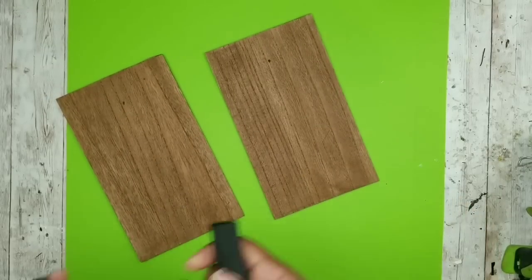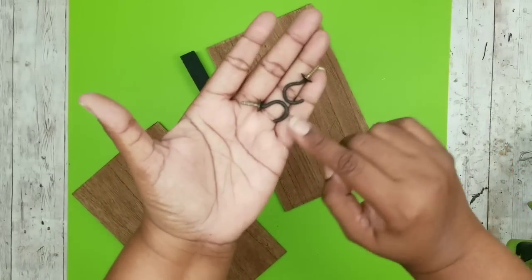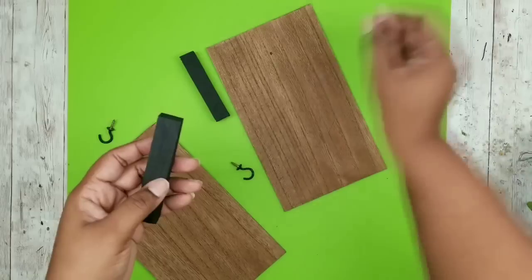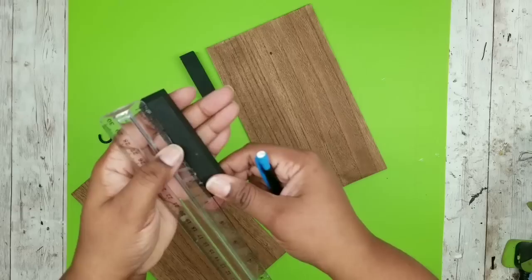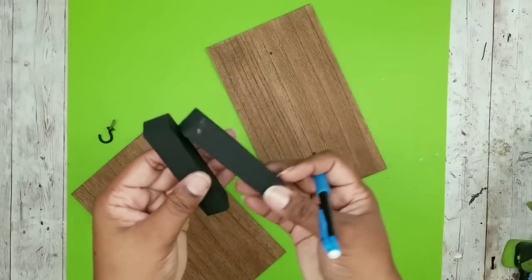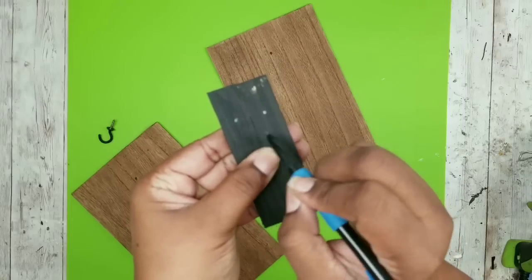All of our pieces are now dry and we can start working on the assembly. For the four-inch piece I'm also going to be using these little plant hooks - they're called little plant hooks and you can get them from any hardware store, fairly inexpensive in a 10-pack for maybe a couple of bucks. For our wood pieces we're marking down one inch from the edge that does not have the hole, making a small pencil mark to create a tiny pilot hole for those plant hooks. This harder wood needs a pilot hole to prevent it from splitting when we add our hooks.